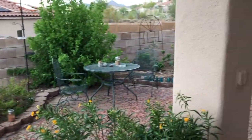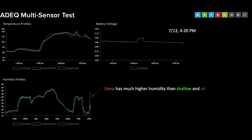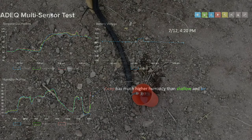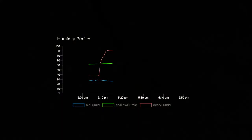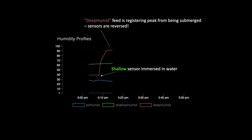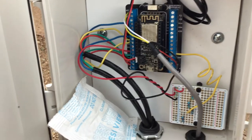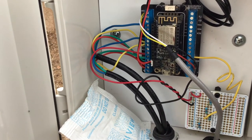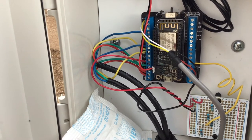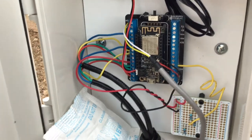It's raining so hard — nice fat drops! During and after the storm, I checked my sensors via the Adafruit IO feed and discovered that my deep SHT10 sensor was registering higher humidity relative to the shallow sensor. This led me to suspect I may have switched the placement of the sensors, so I immersed the suspect shallow sensor in a cup of water. That confirmed I had a problem — the sensor immersed in water was yielding a signal on my deep humid feed, meaning I had in fact reversed placement of those sensors. The cool thing about those terminal blocks is rather than re-soldering or unburying sensors, all I had to do was unscrew those terminal headers and switch the two data lines coming from the SHT10s on the fourth and eighth pins.